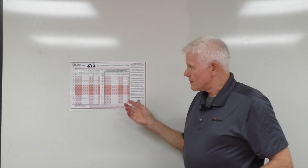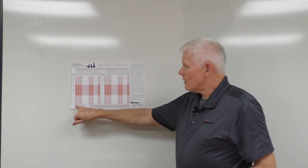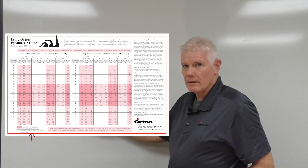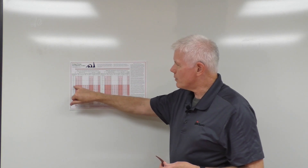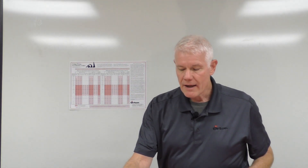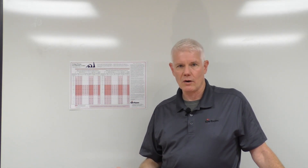What we want to talk about within this chart is what all these colors and columns are giving you information about. Down here you'll see a key that tells you, based on color, that there are cones made with red iron oxide and some without. Red iron oxide is the material used in a small segment of our cone series, falling between cone numbers 010 and cone number 3. These cones take on the appearance of red brick and can be problematic in kilns fired in a reducing atmosphere, such as a gas kiln where you adjust the gas-air ratio to more reducing than oxidizing.